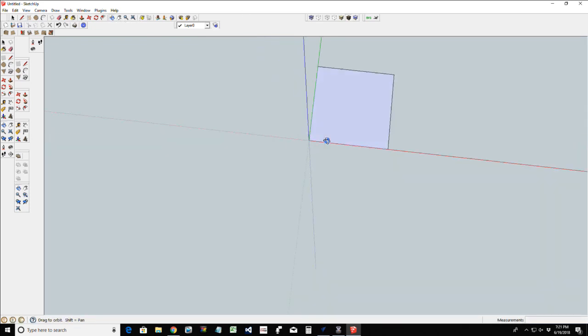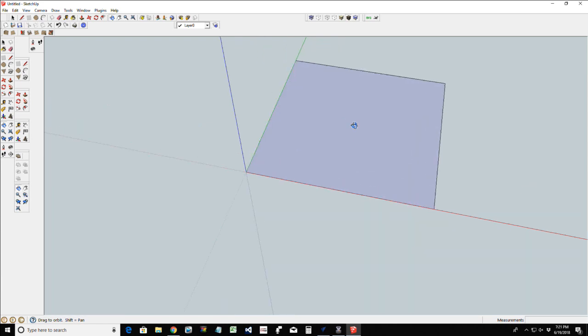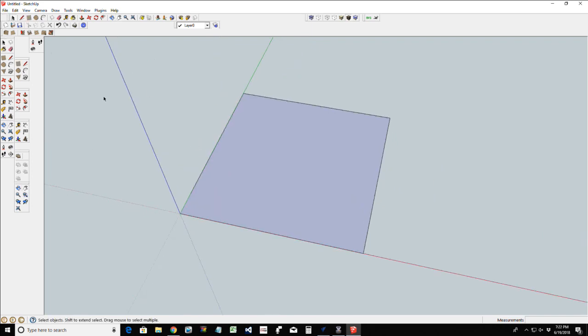And let's go ahead and get this kind of tilted so you can see what's happening here. With the 6 by 6 rectangle, I'm going to be using half inch material for the base. I can use half inch material for the top as well. We can go 3/4 inch all the way if we wanted to. Two things that we will be using in this project that are not going to be made on the CNC are our dowels. So we're going to be utilizing some short pieces, 2 short pieces of 1/4 inch dowel stock.